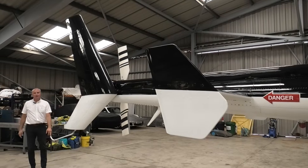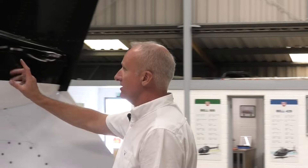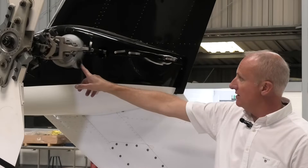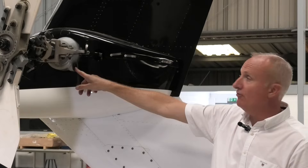The final part at the tail end is the stinger. Moving on from the stinger, the next thing we check is our tail rotor gearbox oil level. We can see the sight glass here, conveniently outside of the cowling, and the level is halfway up, which is good.